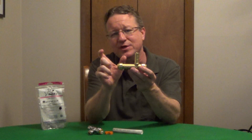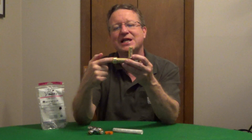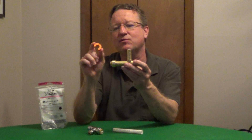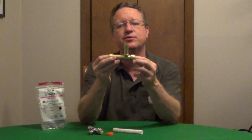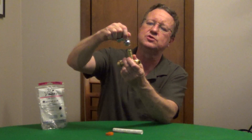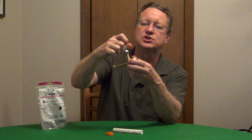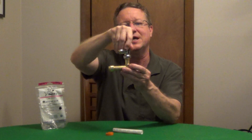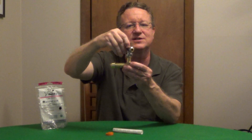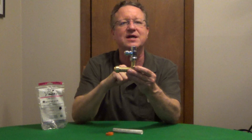All you have to do is cut out a two inch section of your pipe. You're going to slide this over the pipe — they have a release tool so that you can back this up. You're going to connect it to both sides, then just push the shutoff valve onto the tee, and you have a shutoff valve that you can actually rotate. This is water tight, so just a very easy way to add a shutoff valve.